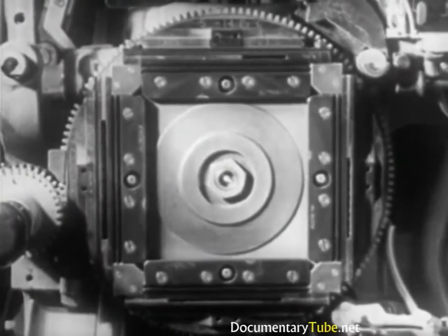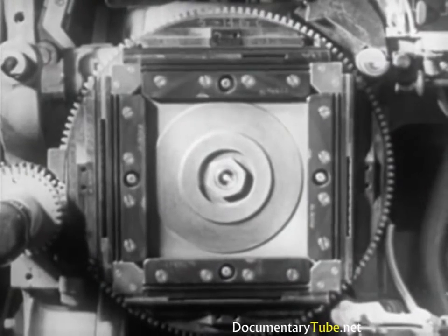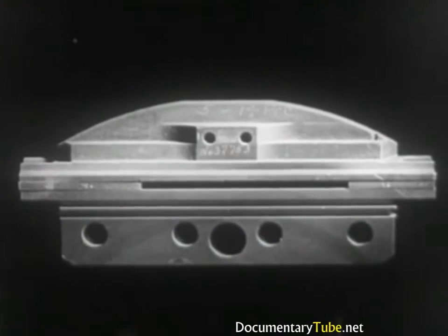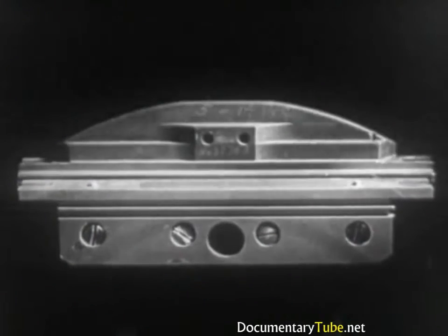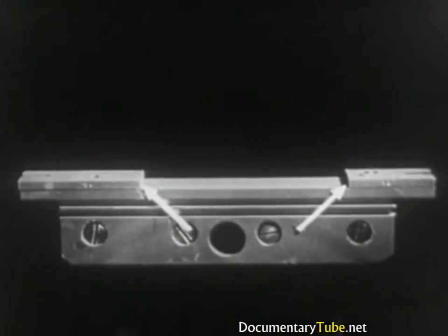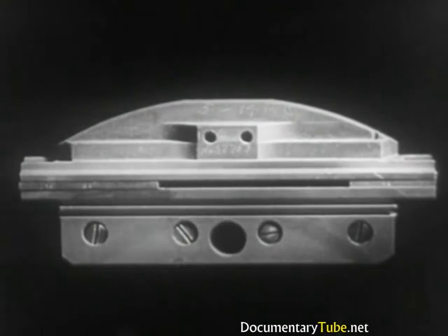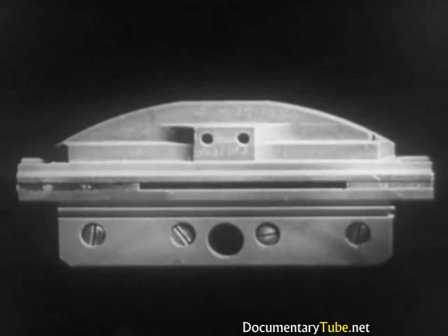The mold is mounted on a rotating disc. The disc has teeth geared to a pinion activated by two sections of gears, so that it rotates at intervals. Normally, the wheel carries four molds for casting. The mold is made up of the body, fastened to the disc with four screws; the cap; and inserted between them, depending upon production needs, precision liners — constant length at the right and variable length at the left. The liners determine the length and thickness of the slug, establishing the dimensions of the lead slug, which may vary in length and in thickness.